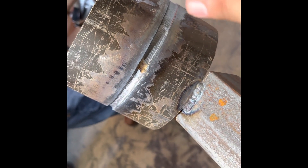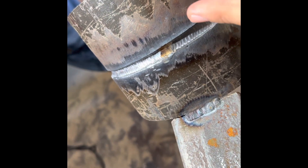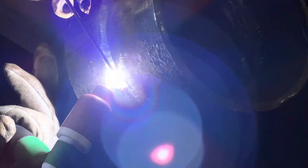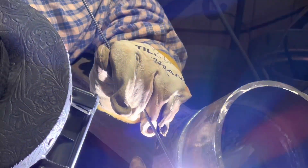Turning up to 150 amps to start the fills. You can either throw one fill on the bottom or, if it's narrow enough, just keep flushing with one bead. Make sure you burn both walls — heat is your friend, so turn the machine up. Go side to side; the heat will burn both walls. This pipe is pretty thin so lack of fusion isn't a big problem here. Keep the wire on the top side of the bevel.